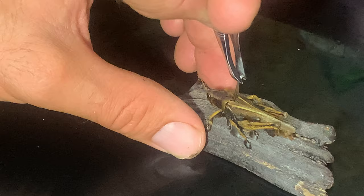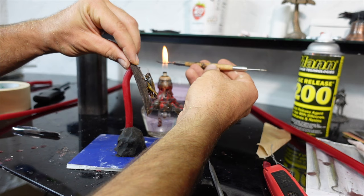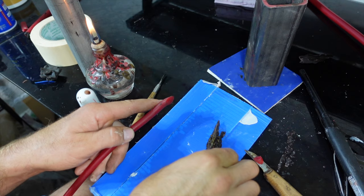I'm not going to want that metal pin in there when I cast it, so I decided to remove that. Those blobs of molten wax don't look very good, so by using a dental pick I can put the wood pattern back in the wax. Now it's time to sprue it up — pretty straightforward. I'll have one sprue enter from the bottom so it fills from the bottom up, and one vent at the top so any gas can escape.